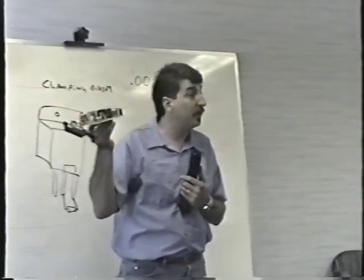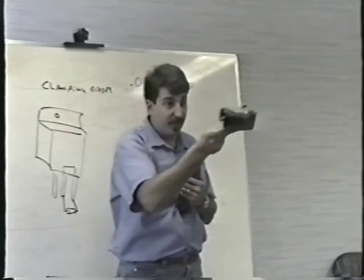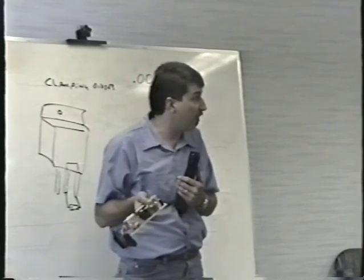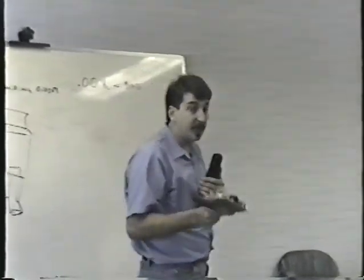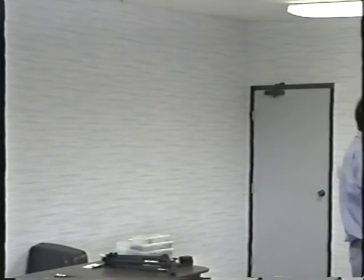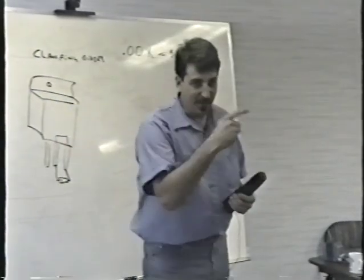Now I know what's wrong with this one. And in fact, before we fix this one, since there's only seven of us here, we each might as well see every power supply that has a problem in it and see what's wrong with it. I'll pass this around later on so that we can take a look at it. All right. So when you get to a power supply and you find that the fuse is blown, check, I guess, these four things. Check the transistors, the clamping diodes, the bridge rectifier. And if all of those things are good, then check that blue, well, it's not always blue, check that capacitor that's right across the AC input. Does that make sense to everybody? Anyway, all right, let's get back to this so we can fix some of these things.